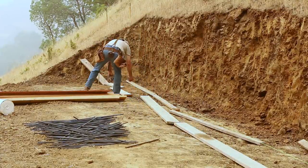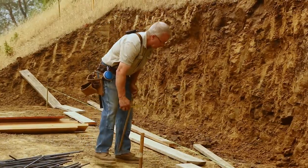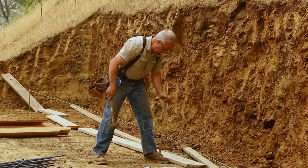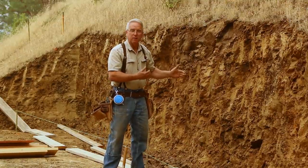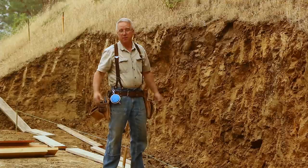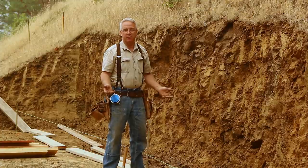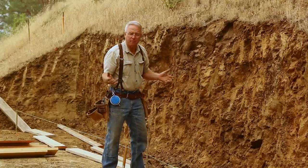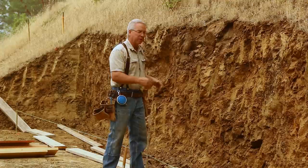Four foot four — I think we're going to put another bend in here. That's just too much concrete to throw away. It's an interesting calculation: why would I concern myself with putting an extra bend in this footing? It's to save concrete. If I'm a foot too wide over the call-out on the plans, every 27 feet is a yard of concrete — that's 110 bucks. So it's a cost-benefit analysis of how much labor it costs to save the 110 dollars in concrete. If I had taken this job on a bid basis with a crew working, I'd ask: do I want those guys to stop production for half a yard? Maybe not. But since it's only my time, I'm going to crowd that back and save the concrete.